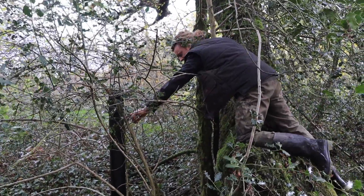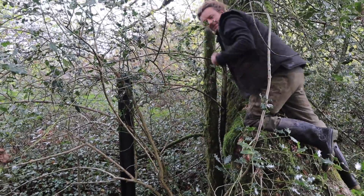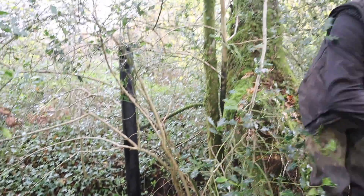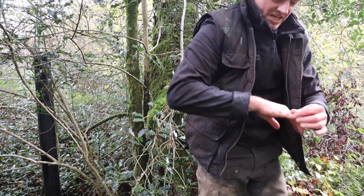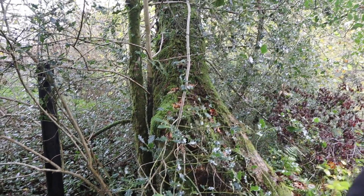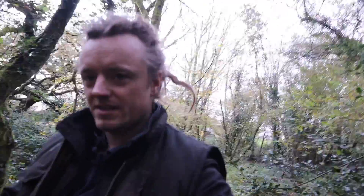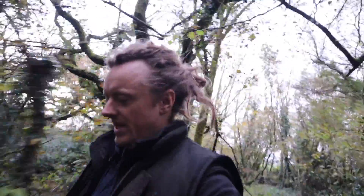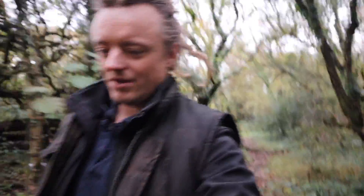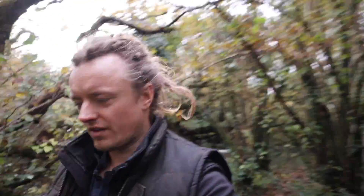The water level is here. That experiment ended up costing me a lot of time and energy — don't put your standpipe too close to the intake. There's something not quite right with the hydro. I thought it was an airlock, which is why I moved the standpipe, but we're down on power. It should be running at about 480 watts but it's running at about 430.